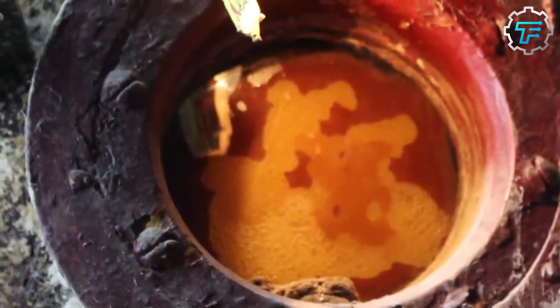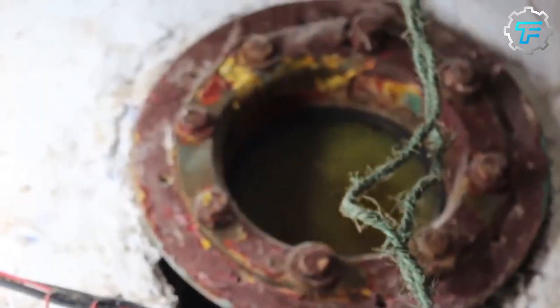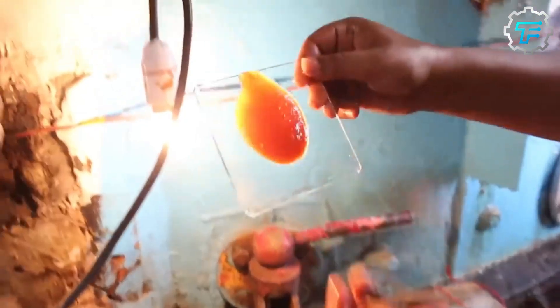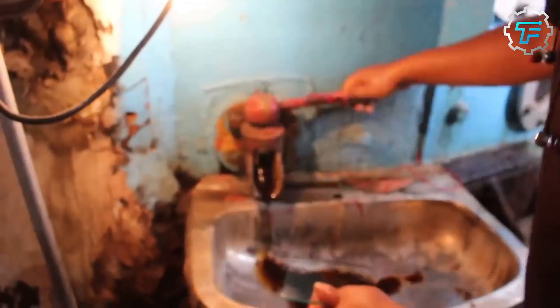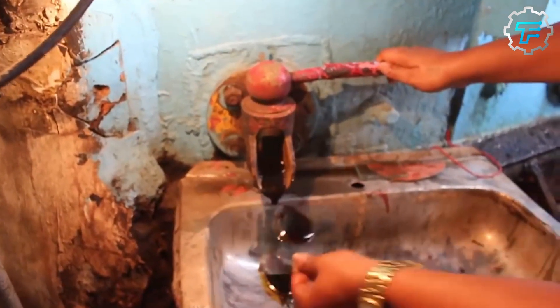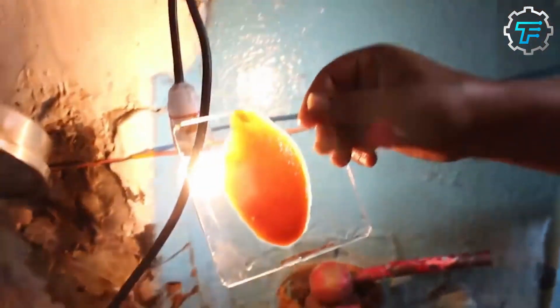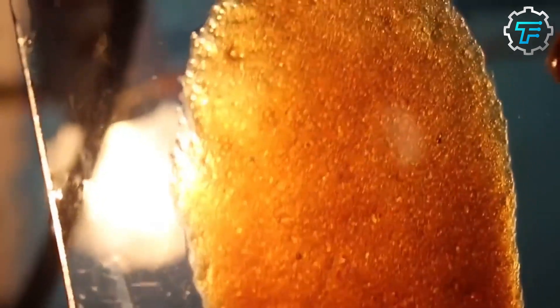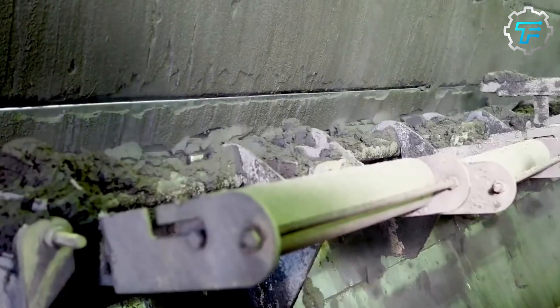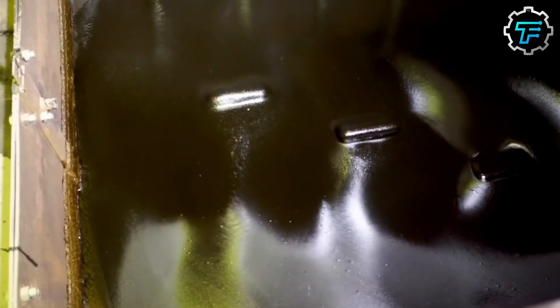The remaining juice is heated to denature the proteins that may be present, and lime water is added, which causes a sludge of unwanted materials to settle at the base of the tower. This process takes several hours, and at the end, the sediment is removed from the bottom of the container, while the remainder of the juice is taken from the top. However, the sludge is not discarded yet — secondary filtration is used to extract any residual sugar that might be inside. After the extraction, the remaining substance is referred to as mud, which can be used as fertilizer.